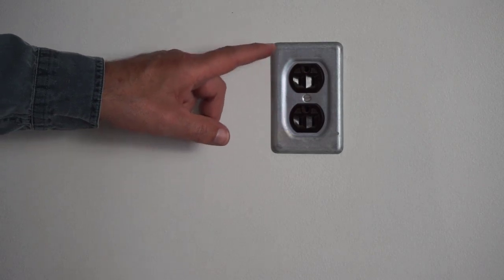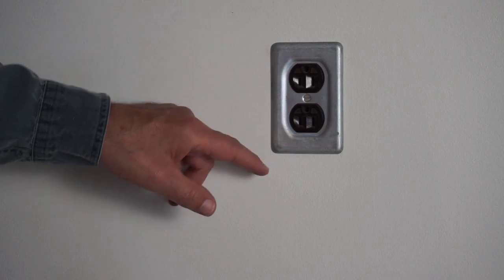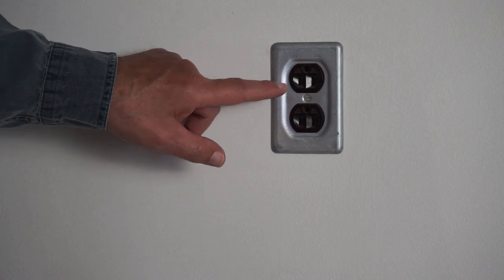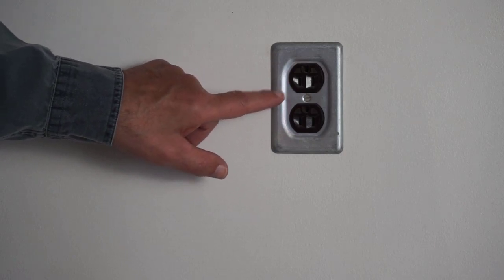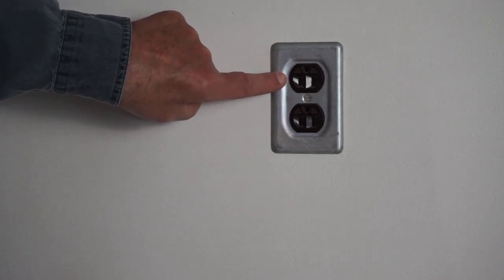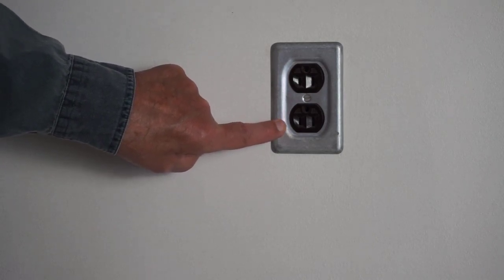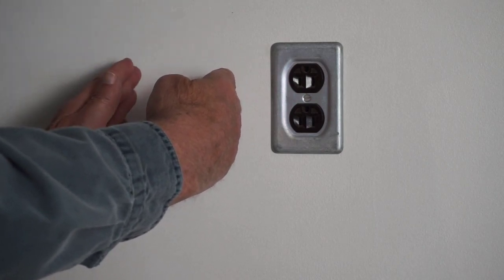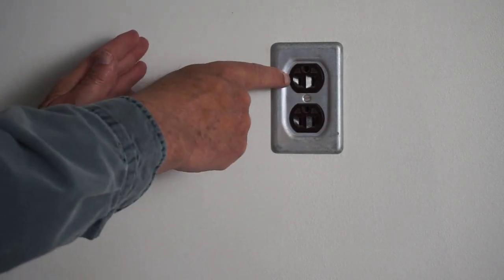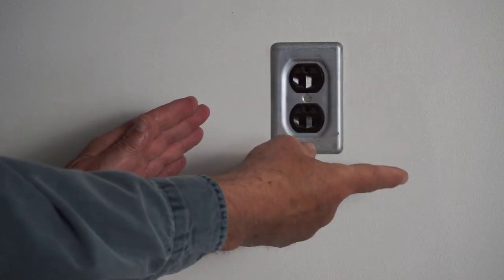Time to talk a little bit about our 120 volt North American standard, which is actually a 240 volt standard. This outlet is kind of special — it's a split plug, and we commonly find these around our kitchen counters as well. This top receptacle has its own fuse and so does the bottom receptacle. Our system has an L1 and an L2 with a neutral in the middle, so this receptacle is on one side of the neutral and that receptacle is on the other side of the neutral.